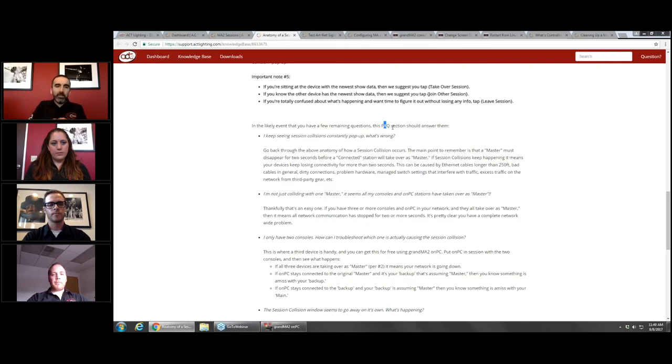If this little LED power supply was designed for a couple universes of sACN and you flood it with 100 universes of sACN and 100 universes of MA-Net, that's a lot of packets that that little processor has to open up and throw away, and it usually cripples them. That's the whole point of managed switches. We make that super easy for you with the MA network switch.